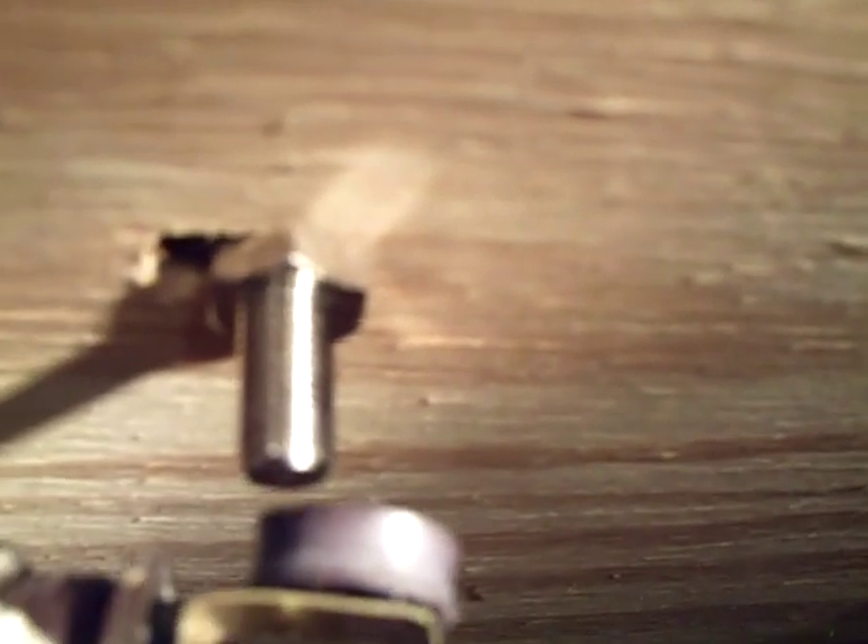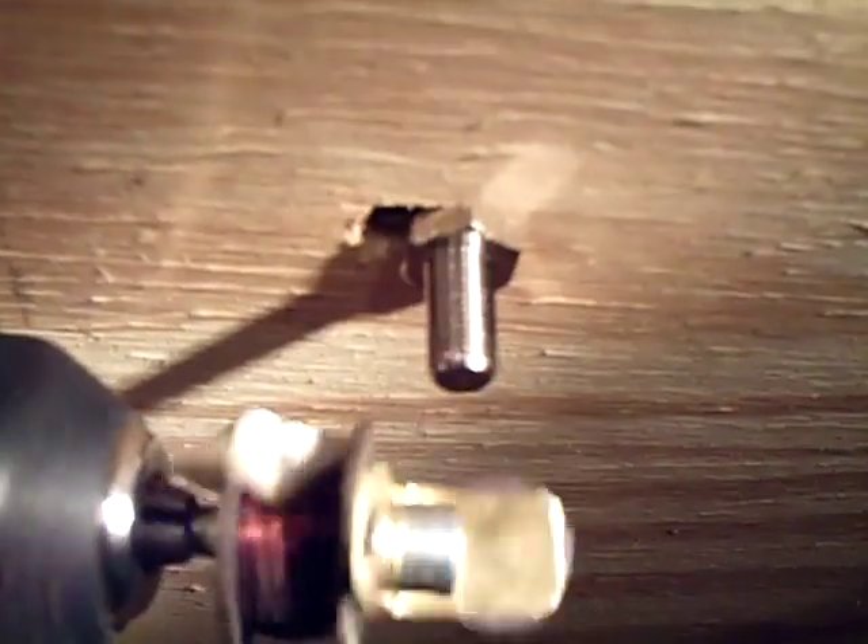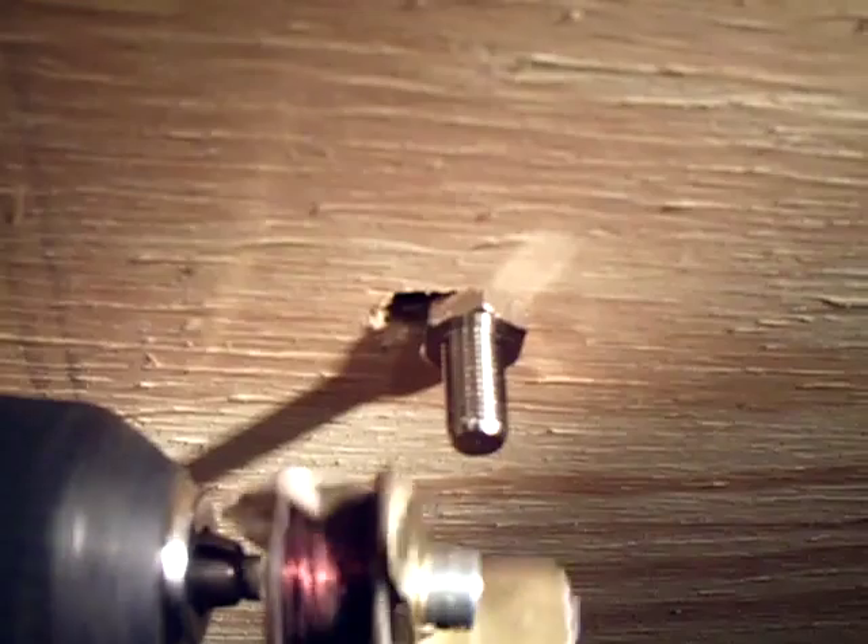The fastest this switch could pick up is 230 cycles per second, so I'm way under that. It goes around - there are little reed switches in that magnetic sensor. When the magnet comes around, the switch is deformed to make contact, going from normally open to closed, normally open to closed - and then the counter counts up.